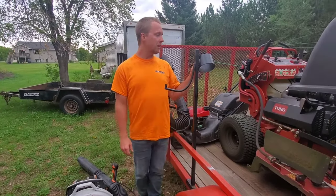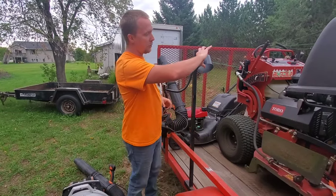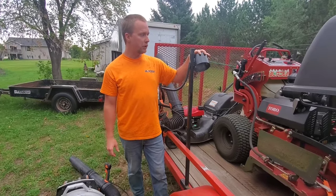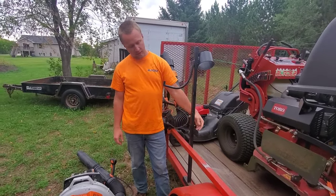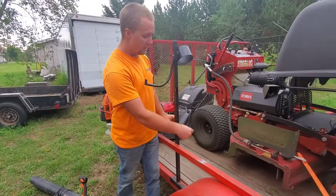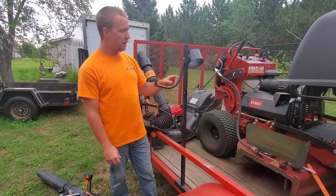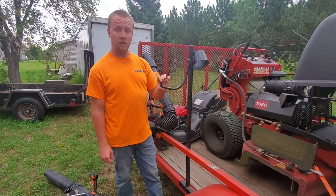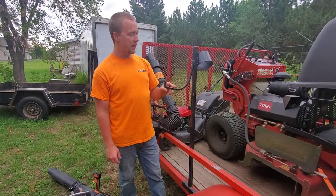It's a very simple design. This is about four inches — three and a half or something like that — of five-inch round tube. We have a saw upright bar here, this is one-inch tube. Down here we have some two-inch flat which I drilled a couple of holes in; this holds the bungee cords which wrap around. Super simple. This is some half-inch cold rolled mild steel, which I welded a little nub on here. I hand bent this at home.